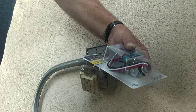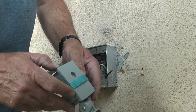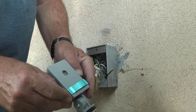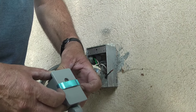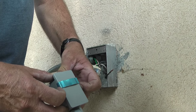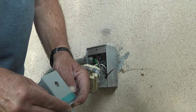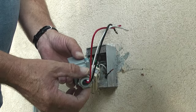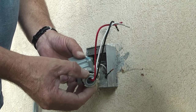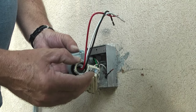This is the new photo cell. I bought it at Home Depot for around $12. Notice that this photo cell has a slide adjustment on the body that I can slide over the sensor to adjust when the photo cell turns on and off. On at dusk and off at dawn works for me, so I'll leave the adjustment bar alone. I won't need this lock ring that came with the photo cell either, because the base of the photo cell will thread into the outlet box.